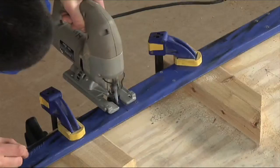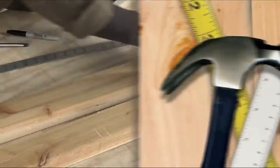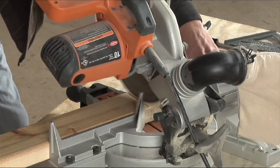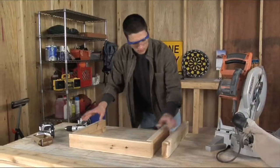Safety glasses on. Cut the cedar 2x4s at a width to match the width of the chair back and a depth of 15 and a half inches. This will leave 2 inches of overhang on the seat. Assemble the square form seat base.